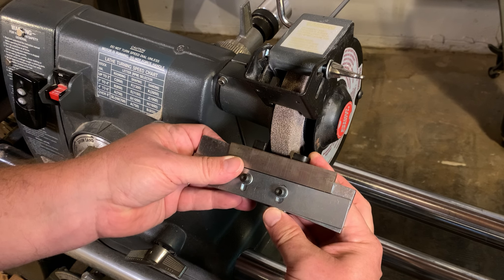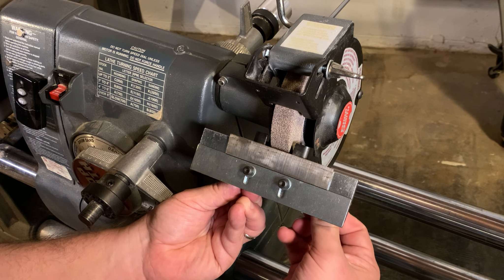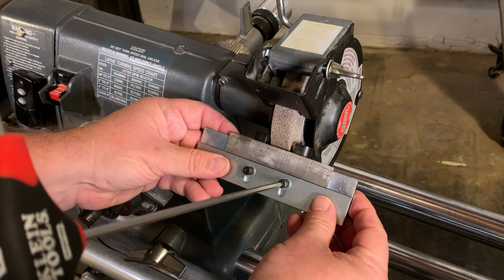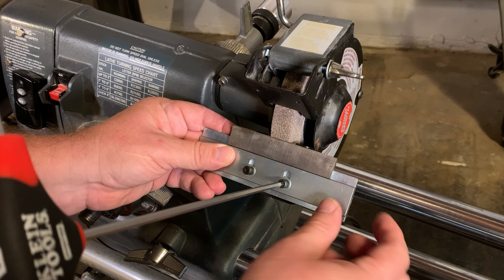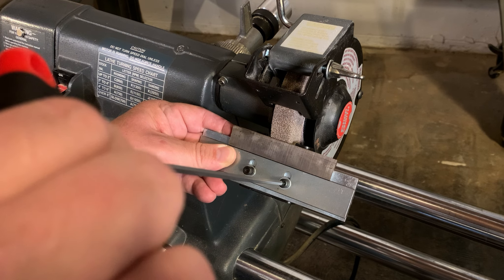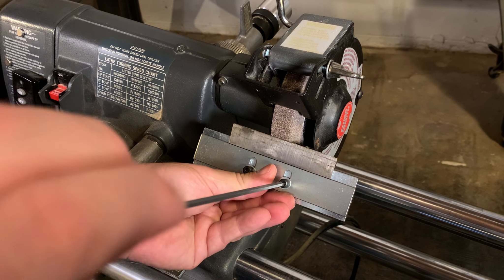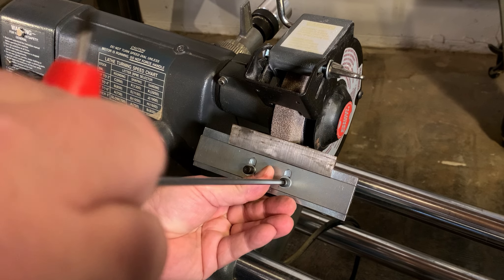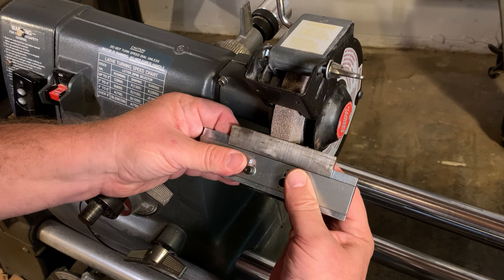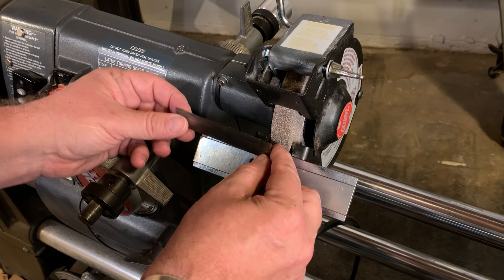This is everything included in the accessory kit for joiner and planer knives — pretty straightforward, just a couple pieces of steel, one with holes and one with slots. On the tool rest we have threaded holes, so we can align the piece and run screws through, holding it in place. This acts as a fence that allows us to slide the blade closer to or further away. We also have cap screws and washers — it's important to have the smooth side down so they don't dig in, as that gives a false sense of tightness and the blade can slip.